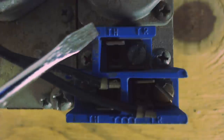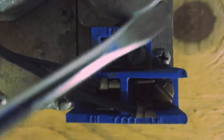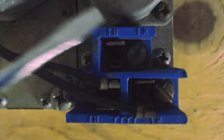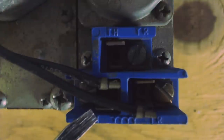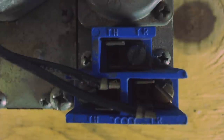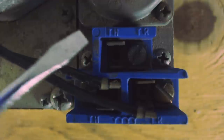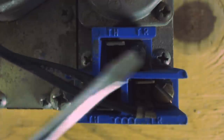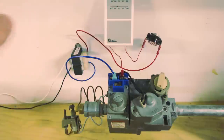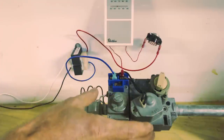The TH-TR is just an empty junction area. You might have a 24-volt hot coming in here and then coming out going to a thermostat or a safety control and then over to the TH. But it's just an empty junction — it's not connected to anything, just a place to gather wires and connect them. That area in some manufacturer literature is called the common area, but once again it's not connected. So this is the common wiring setup for a combination gas valve.